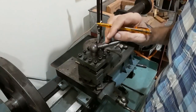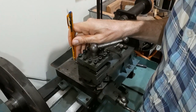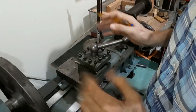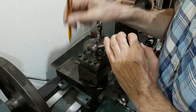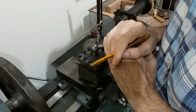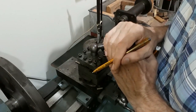When I look at this setup here, one of the major loads is the vertical load on the tool. This arrangement seems to be quite adequate for coping with those kinds of loads. A vertical load onto the centre line of the I-section beam is catered for fairly well.